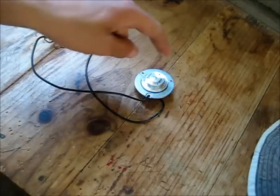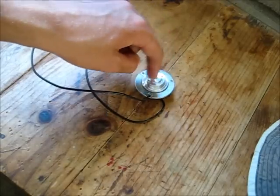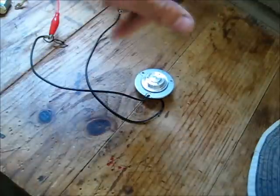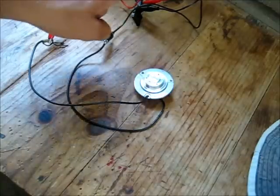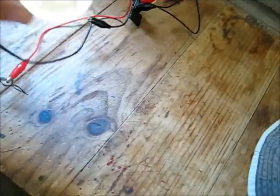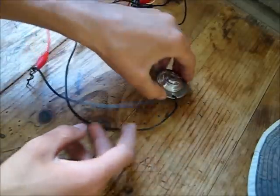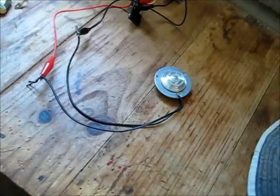I got this hard drive motor. I actually found out, done an experiment before with a small transformer, these actually run off 50 Hz AC. Once you flip them and kickstart them, they'll run off 50 Hz of two of the phases. So I've got it tapped into the AC side of the rectifier here. Just tapped it in straight off the AC side. I'm going to check that nothing's shorting out. Running on 50 Hz, this thing gets really, really hot. But it keeps running amazingly.